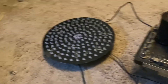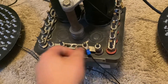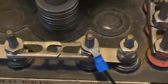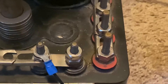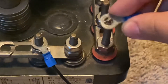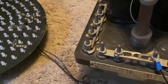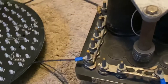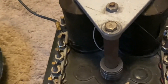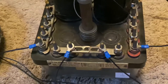If you have two lights, you are going to put one wire onto this center terminal and put the other wire onto this terminal. We are also going to do this with the other LED — that wire goes to that terminal and this wire goes to this terminal. Now you're going to want to tighten those in.